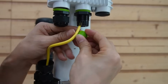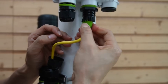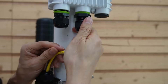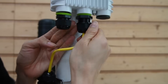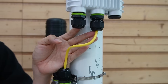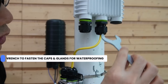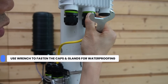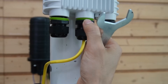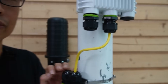We also need to add this O-ring. This is one important step to install this gland. We need to use a tool to fasten the cap and the gland, so it presses and squeezes the rubber to generate high pressure to stop water or moisture from entering into these devices.